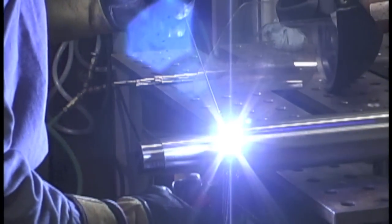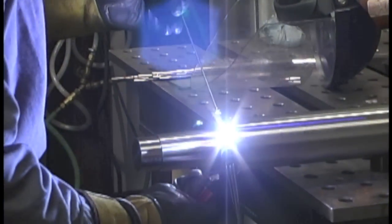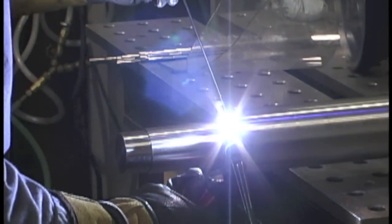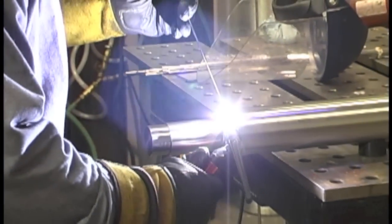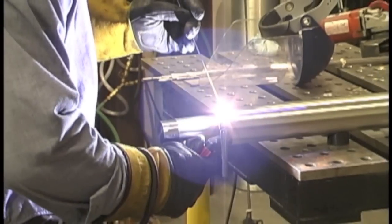What I'm going to do here is walk the cup a little bit and also do some free handing, but on the first pass I'm just going to walk the cup because it works out nice. I've got to weld all the way around it several times, and walking the cup lets it lay in that corner really nicely — walking the puddle right up to where it just nips that ledge and then coming out the same distance the other way.